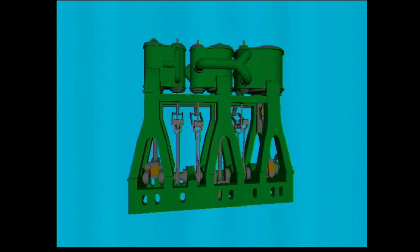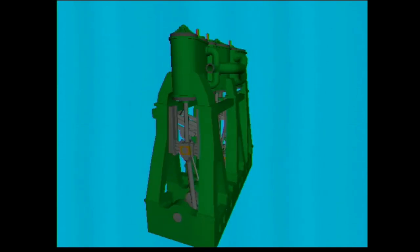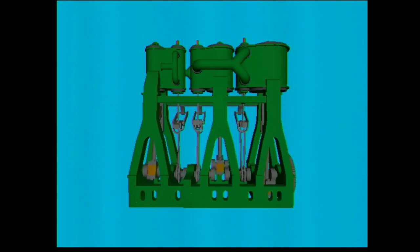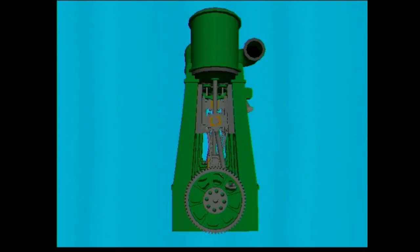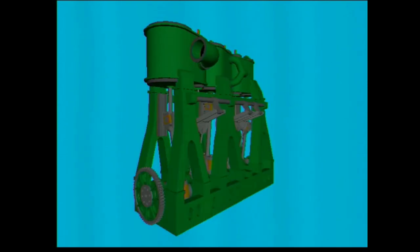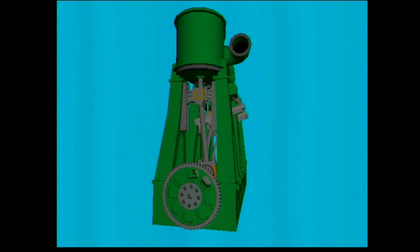The intro is textured, so artifacts aren't weird. But this demo is running now. It's a bit slow because it's way too high in polygons for Voodoo2, and it's obviously written by me, so maybe not optimized. It's more suitable for GeForce 256 or something. But it's untextured in the demo, so it doesn't use the TMU, it uses the frame buffer chip for geometry and drawing the image. So the fact that this looks artifact free tells me that the FBI chip is probably fine. So I suspect there are issues with maybe the RAM. Because these cards were abused, I'm not that surprised we have issues.